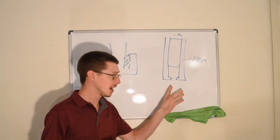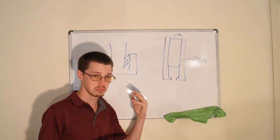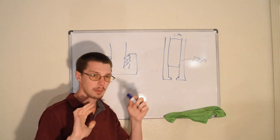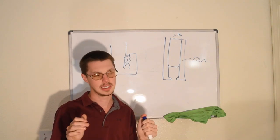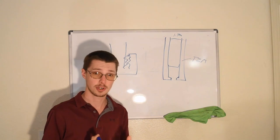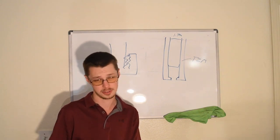The specifics of why molybdenum is anti-wetting with molten metals is a little bit complicated, and I'll put some links to papers and other information in the description for people who are interested. But the gist of it is that the molybdenum has a relatively small atomic radius, and it has a relatively low surface energy because it has a limited number of electrons compared to other group 6 metals.